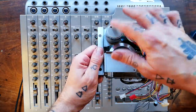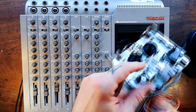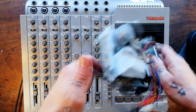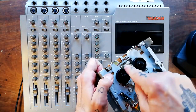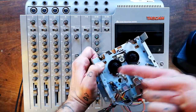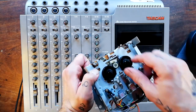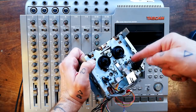This is a three-motor unit. Here's your capstan motor — that turns this flywheel, and that makes that little bit of metal turn, and that's what's making your tape go at a steady speed. This is your reel motor, and that will press up against here or here and turn these, so that's rewind and fast forward. Also, this will turn a bit faster than your capstan motor when you're in play mode to make sure the tape stays tight and doesn't build up.